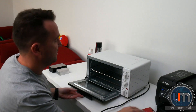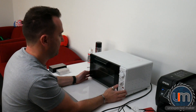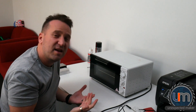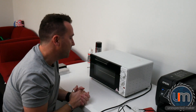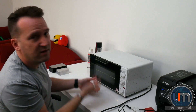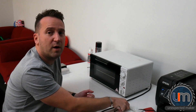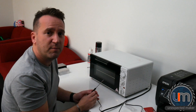Because the way I do it right now, it's pretty funny. I'll turn the oven on and set it to 80 degrees and wait and keep waiting, and then when I think it's going to be around 80 degrees, I'll go — that feels around 80 degrees. I'll close it, let it go for another 30 seconds, then grab my boards and put them in. By the time I place them and close it, the temperature's probably dropped to 60 anyway, and I have no idea where it is from that point onwards. Then it's all luck. So rather than using luck, I'm going to use a probe so I can at least get a rough idea what the temperature is. This is by no means the most expert way of doing it, but it's better than the way I have been doing.